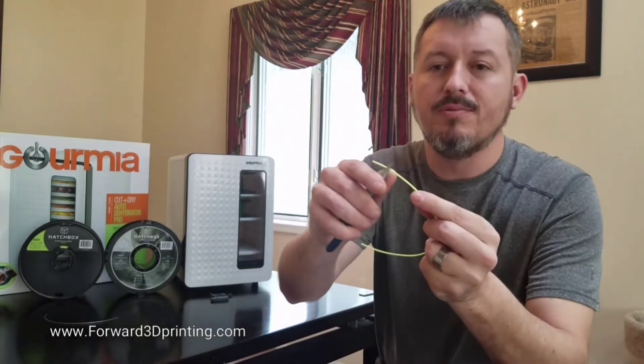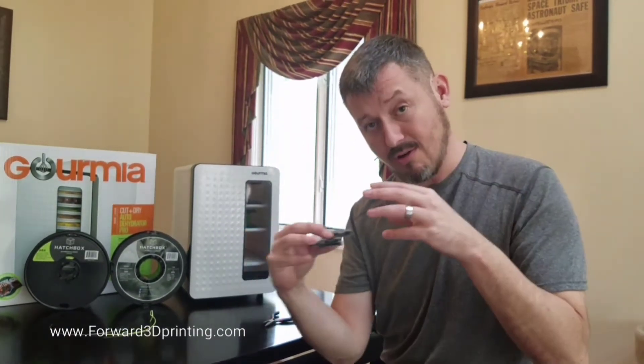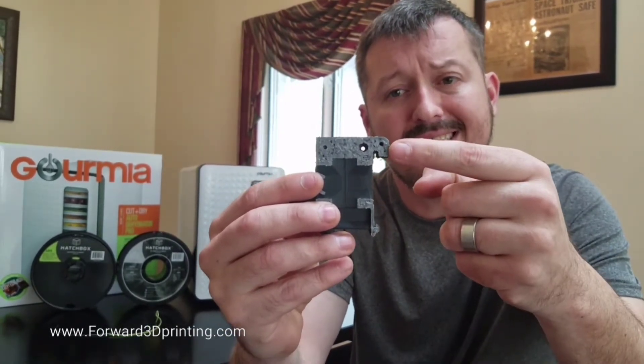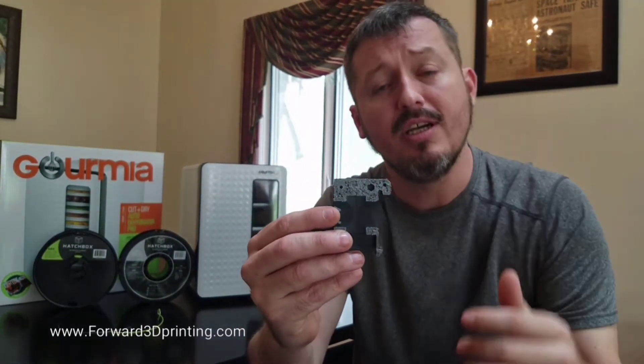With a dry material, it just bends, right? When the material is wet — remember, it's moisture, you can't run from the air — you're putting it through a hot end that is about 180°C in PLA to 240°C on ABS. Water boils at about 100°C, so when you start pushing wet material, I have a sample here — I printed this on carbon fiber, and above it I used that same silver ABS. The layers just ran amok. It was a mess, because I'm pushing material with steam. It's bubbling, it's just running into each other. It's not the material's fault — it's my fault for having opened it and letting it get wet.